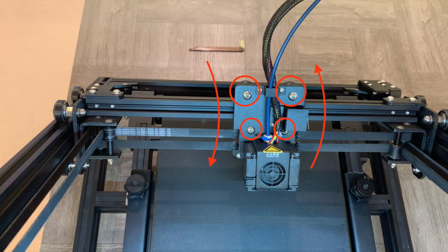It's quite easy to rotate the plate out of plane by hand. If you try to tighten the eccentric nuts on the wheels, they wear out exceptionally fast and also make the steppers work harder.